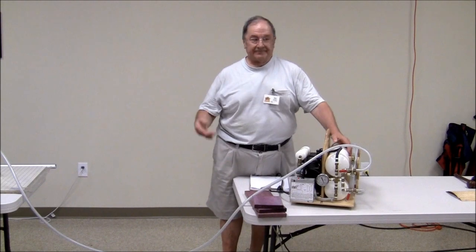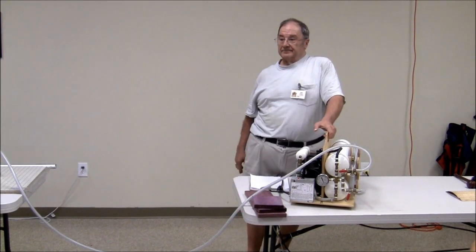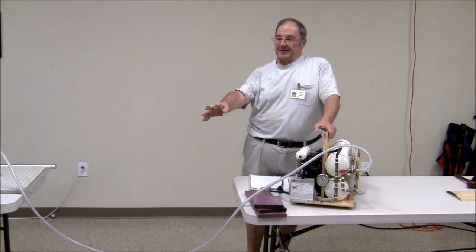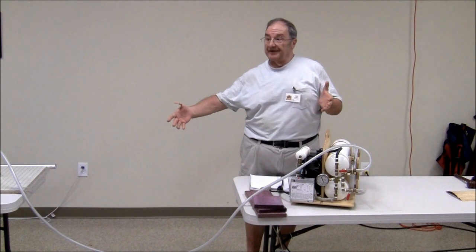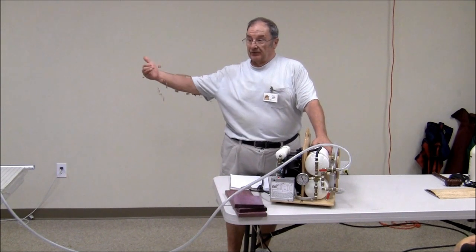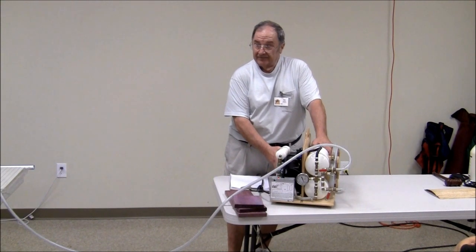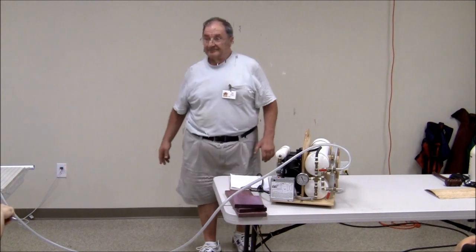Once the system's sealed and it's pumped down, you're not supplying any air until the pressure in that system drops. And then it uses a reservoir on your air compressor. To make Dan feel better, if he wants vacuum pumps, that'll just make your air compressor run less frequently. That's all. You could build a system using tanks like this, hooked up to a compressor. The only thing you're removing out of the equation is the vacuum pump itself. I understand that. You could take that pump off and put a venturi in there.